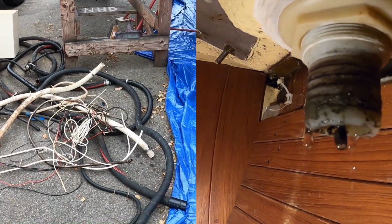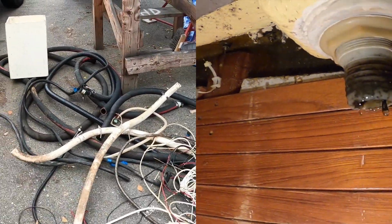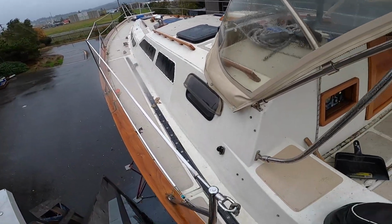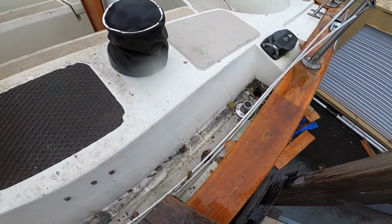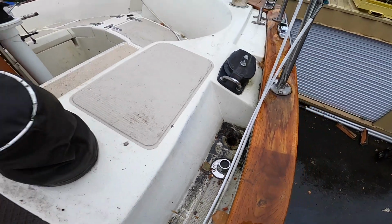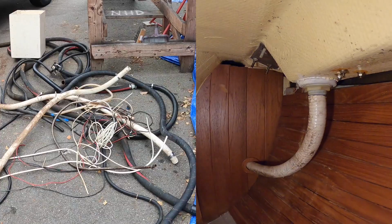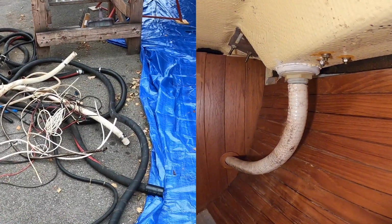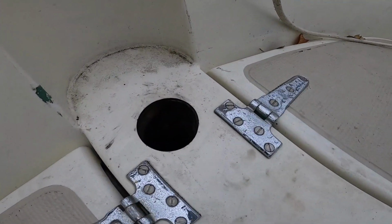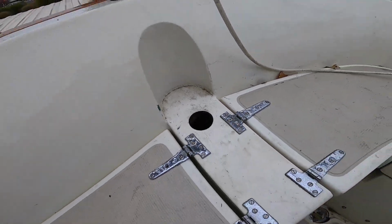I'm in the back quarter berth, and all of a sudden there, the light goes on. We had the students remove all those piles of hose, everything but the cockpit drains. Well, come to find out, this is a deck drain. All of the foredeck and the cabin top run down the sides of the boat and go through a through hull. It doesn't have scuppers, so this water all gets trapped, comes into here, and runs out this 1.5-inch hose. And so, luckily for me, that hose was still laying there. I grabbed the 2 old pieces and was able to put them back in place, and out the transom it goes. So while I was looking in the transom, sure enough, the rudder post is leaking.